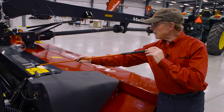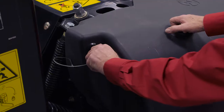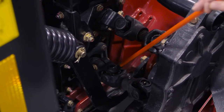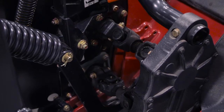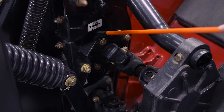If we take a look at that decal we'll find that there are some grease zerks underneath this shield on the right side of the mower. Let's remove the shield and have a look at where they are located. We can see now that there are grease zerks located on each of the drive shafts as well as on the bearings for the bottom roll and the top roll. Grease intervals are reflected by the decal, which indicates that these points are 25-hour lubrication points.